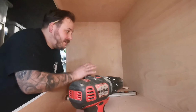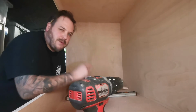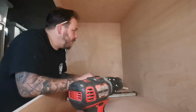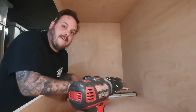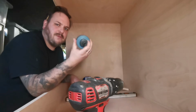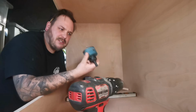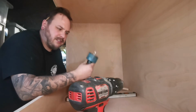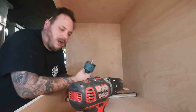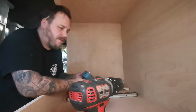Okay, so that is the vivarium completely built, but what I'm going to do before I put it in the hole is drill my air vents, because it makes a much nicer hole if you come in from both sides, and it keeps it clean as well. It stops it getting gunked up and you having to keep forcing a bit of plywood out of it. So that works well, but obviously I can't do that when I've put the vivarium back in.